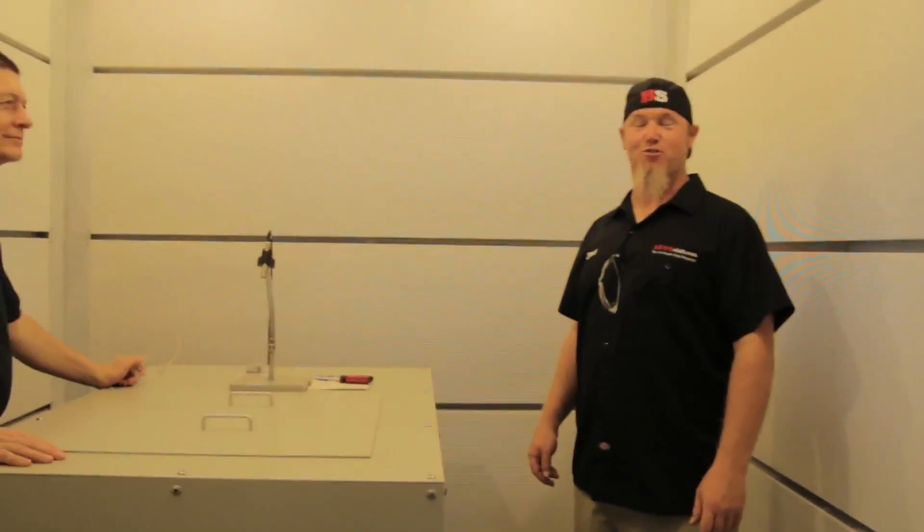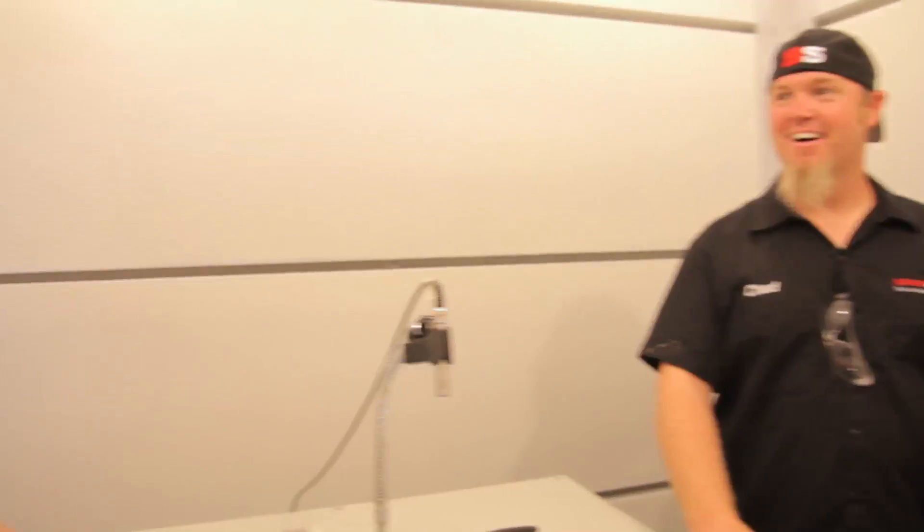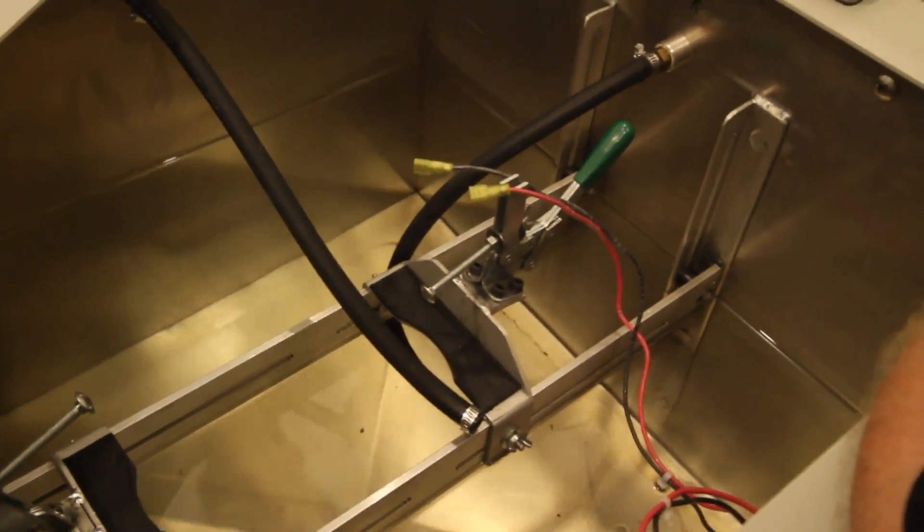This is really cool but it's creepy — you can hear the ringing in your own ears. This is what we call a hemi-anechoic room. It's not fully anechoic — if it were, the floor would also be isolated and insulated — but for what we do it serves our purpose. We put the pump in the test cell with a pickup microphone and we're trying to pick up audible differences down in the three to four decibel range. Your ears ring because it doesn't make sense that nothing should be this quiet.